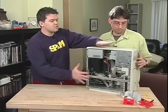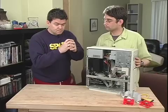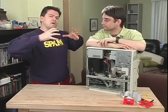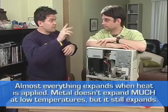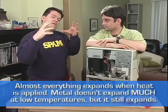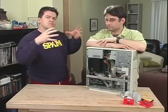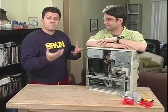Here's the issue too: let's say you get a lot of heat in your machine and you've got a very hot component. What's happening is the actual material it's made of is expanding a great deal with heat. Metal will expand as it warms. Then you flick it off at night and it cools down again, so you get that contraction again. What you end up with is expansion, contraction, expansion, contraction. As we all know, when metal heats and cools, you get fatigue and ultimately it's going to break.